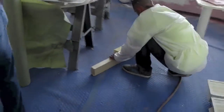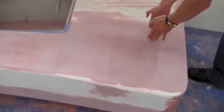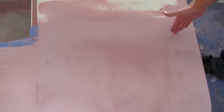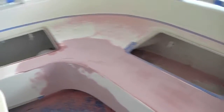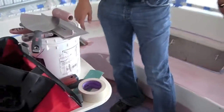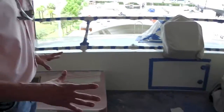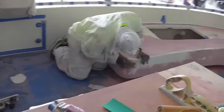This is an aluminum boat, and what we did — if you follow me over here — is we extended the seats. The seats were here, coming in basically even with this line. We extended them 12 inches and tapered back to blend it in, so the customer can sit here and actually eat over the table without being 12 inches further forward.